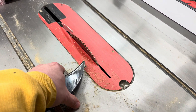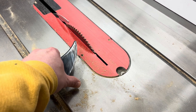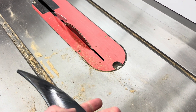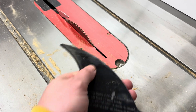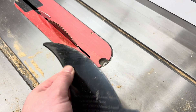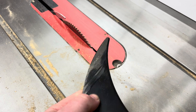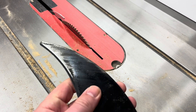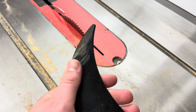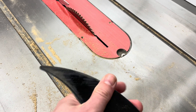I had been using a thin kerf blade — just a Diablo blade — and as soon as I got the saw I swapped it over. I was having problems with binding because the kerf of the thin kerf blade is smaller than the kerf of this riving knife. You can see the marks on the riving knife where it was binding — it's discolored and scraped. It got to the point where it made some of the cuts pretty difficult.